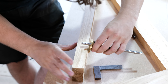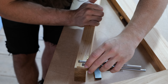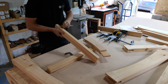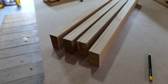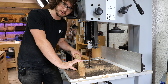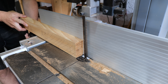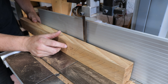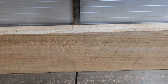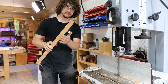Then I'll get bandsawing after I've marked all the others out. Point there, point there — try again from the other side; if they line up — nope. Point, point — now scribe them all the way up to the knife line scratched for the shoulder. Now it's time to start cutting out these male parts of the bridle joint. I plan to set up the fence with the desired offset. When I flip this round the other way, by the time I reach the line on the top I'd be cutting beyond the line on the other side, so before cutting I'm going to quickly square a line from that one down round to the other side to ensure I don't accidentally cut beyond it.